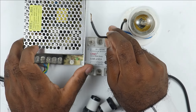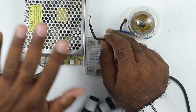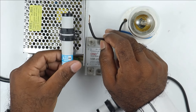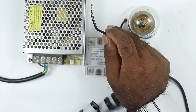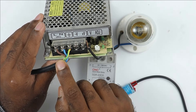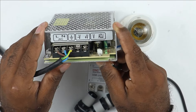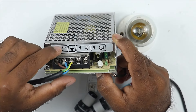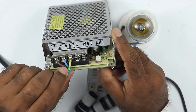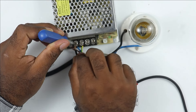I will also use SMPS here. This SMPS will convert my AC power supply to DC, which I will use to provide power supply to this sensor. The neutral wire of the lamp — in this SMPS where I have connected the AC power supply — I will also connect this wire to the same terminal. You can see here it is written N, which means the neutral terminal is here, so I will connect this wire to that terminal.